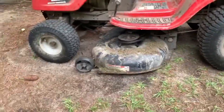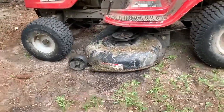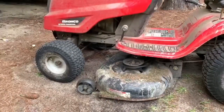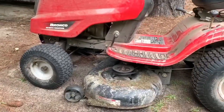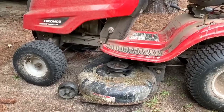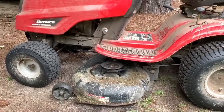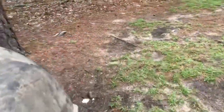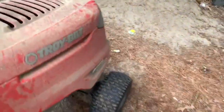If that deck is not level — there's a leveling bracket on the front and on the back you can adjust it up and down — make sure your deck is level or the belt won't run true and you'll be breaking belts. I figured out a position where it won't break belts; they just won't stay on. That's why I pulled off the safety guards on the belt because it kept coming off and I'd have to screw them back on every single time.